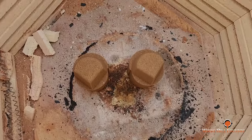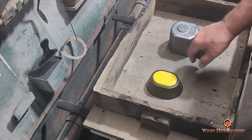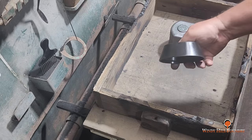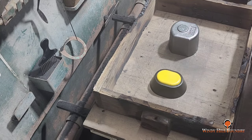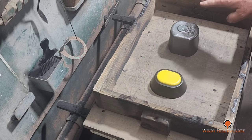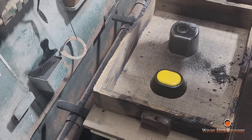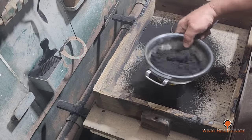We got it in the kiln here. I'll jack the temp up to about 300 degrees and just let it set tonight. These are the patterns that Keith Rucker has sent — if I did not specify, this is what the casting is going to look like. This is just a follow board to keep from having to cope down once we flip it over. Notice how close the top of that is to this — we're going to end up having to put a third bit of sand down, just to kind of insulate this from the bottom. I'm not going to worry about sieving the sand on this piece; we will at least put some good quality sand on top.